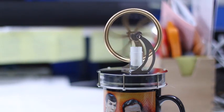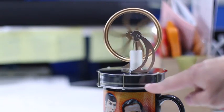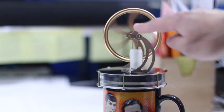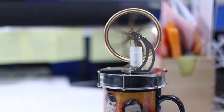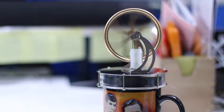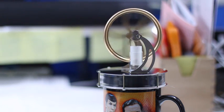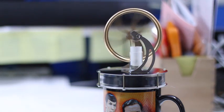You can see the little bellows moving up and down over here, if you look closely. It's just moving up and down, creating a little bit of an air pocket, which then pushes this piston up and down. There's just a standard cam going on over there, one a little higher than the other, so that when one part moves up, the other part's pushing down. And that's all it takes. So this is the Stirling engine — a little something to show off, something fun. And if you're curious about how long it's going to keep moving on that cup of coffee or boiling water, believe me, I don't think you'd have time to watch this whole thing.